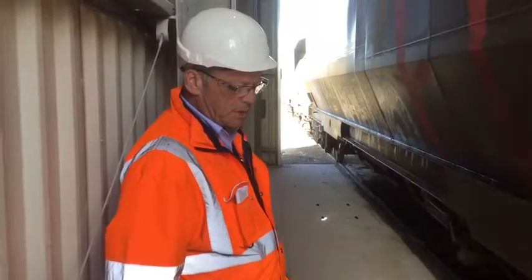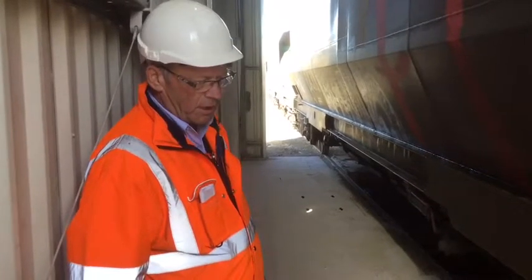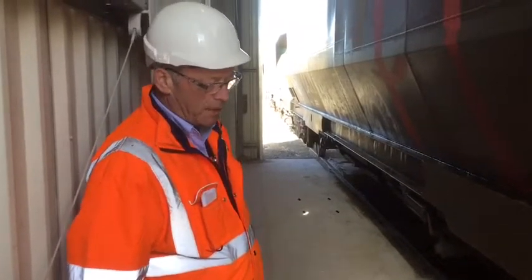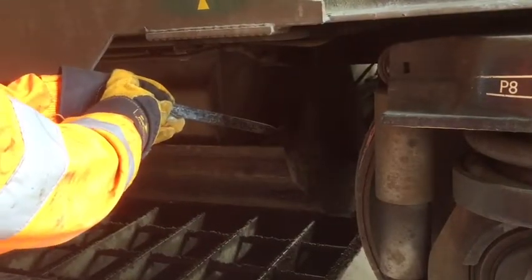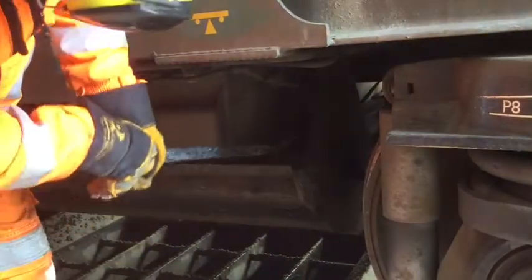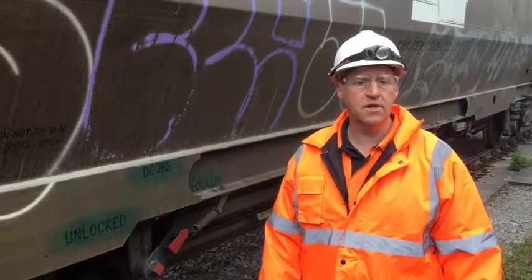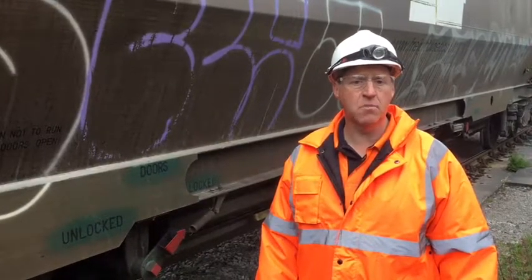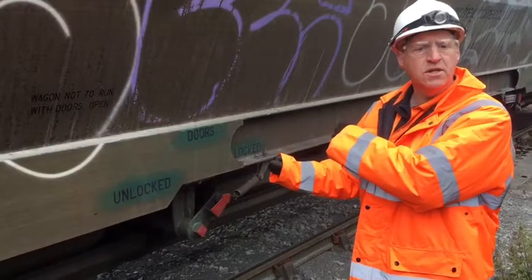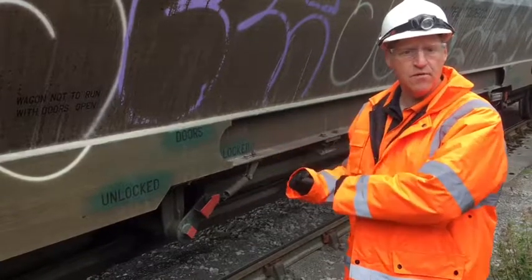To continue with this procedure, once the wagon has discharged all the air, the pinch bar can be used on the correct primary lock to disengage it, as there is no air in the system as shown. A slight push down on the lever is needed to actually disengage the lock. Now as you can see the primary lock has been disengaged. At this point we're going to use a bar to remove the primary lock on the door. The one shown in the video is a fairly short bar — what we would advise is that you use a bar that's at least two meters long, as it removes you from the point of danger and gives you better leverage from a safer position.